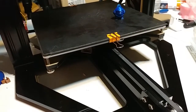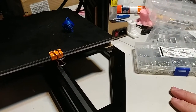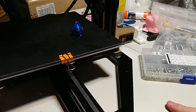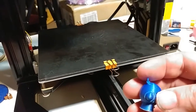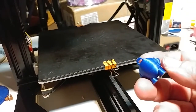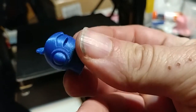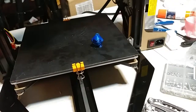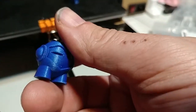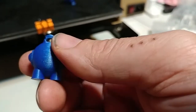I'll provide links to this kind of stuff. If you need it fast, get it on Amazon; if you don't need it fast, just order from China — it'll come eventually, it's all made in China anyway. This filament is amazing — I'll provide a link. This print happened because I had it running at too low a temperature. You can't print this at 195, it doesn't print right — it's really more comfortable at 215, and when you print it at 215 it is perfect. Absolutely beautiful filament. I love this filament.